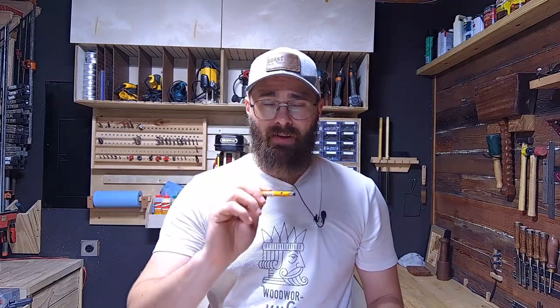Let's talk about the different types of teeth. One type is the flat top grind tooth, or FTG. This tooth has a flat top on it, holds its edge pretty well, and is really good for ripping material. The next type is the triple chip grind, or TCG tooth. These teeth are ground down on the corners, which lessens the opportunity for kerf marks. TCG teeth are found on glue line rip blades, which provide a very good finish — especially where you're going to have a glue line. These blades will often add an FTG in the mix to help with the ripping.